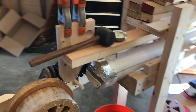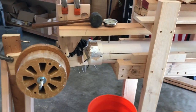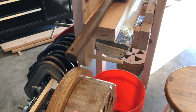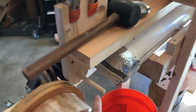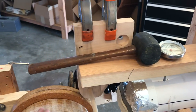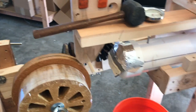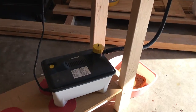Here it is — the great steam bending machine, set up to go. Got plastic on the wheel so that the glue doesn't stick, got my peg in place so that the arch from the steam-bending wood will stay flatter. I got the water boiling as you can hear.